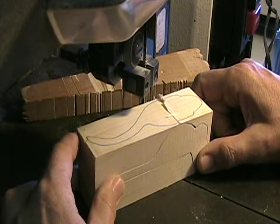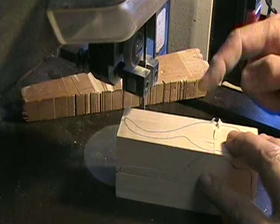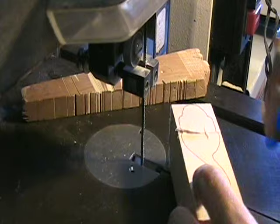Notice that I don't have the blade too far above the piece — about a quarter inch; three-eighths of an inch would be fine. I also have to think about where the safest way to cut is. I'm going to cut the tail first over here because that gives me a good block to hold on to on both sides. I may very well do the other side of that tail at the same time, then turn it around — that would allow me to cut this with some degree of safety.